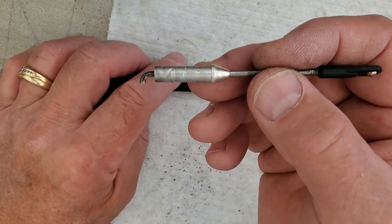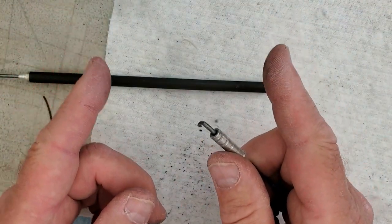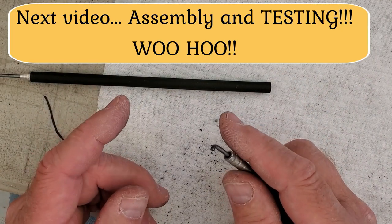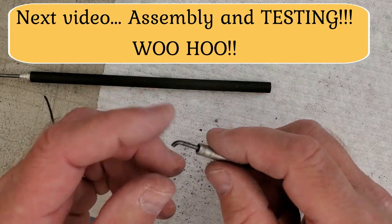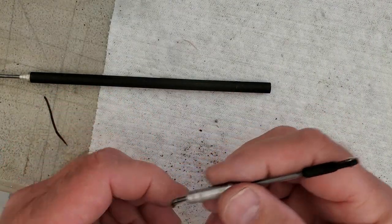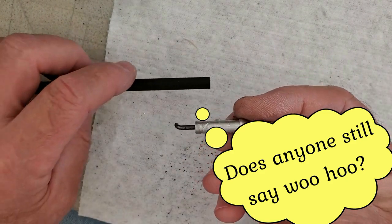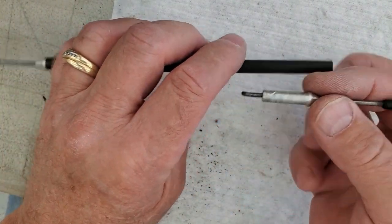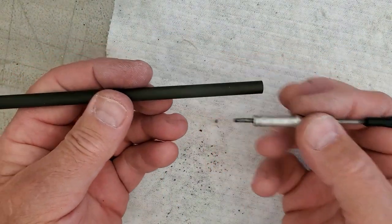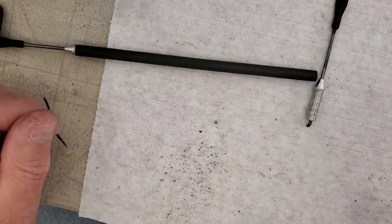How are you going to make a hole in carbon tube? You grab a drill bit and try it — you're going to splatter it. These little rough diamond-encrusted bits: it's about the right size and it'll go through here reasonably well. Light pressure, wiggle it just a tiny bit, and she pokes right through. There's a hole there now. I'm going to extend this out, run it in, pop it through the hole, and then slide this part into place. The aluminum piece has some light grooves machined in it so the epoxy can remain in those grooves — that's why we do that. Slide it in and it'll stay. Thought you might like to see that step.